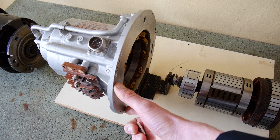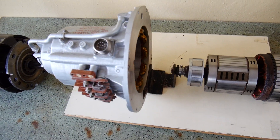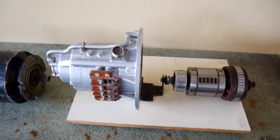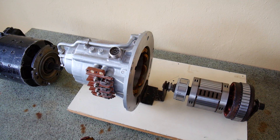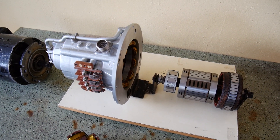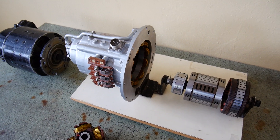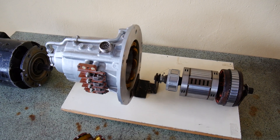When we attach the drive from this side, it is possible that oil will leak from the sealing. The oil pressure in this generator is approximately two bars only. It is a 12,000 rpm generator with 30 kilovolt-ampere power. Its mass is less than 15 kilos — approximately 13 kilos only — which means we get approximately 2 kVA per 1 kg. This is a really great improvement in power-to-mass ratio.